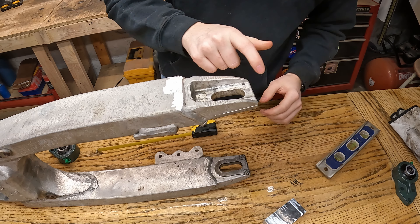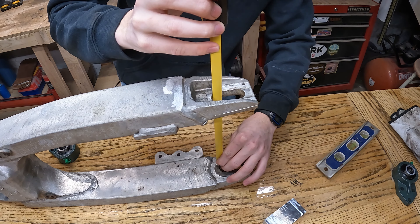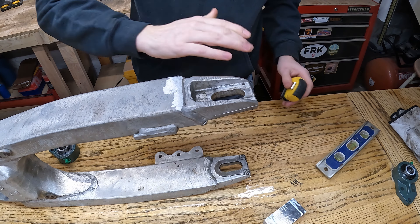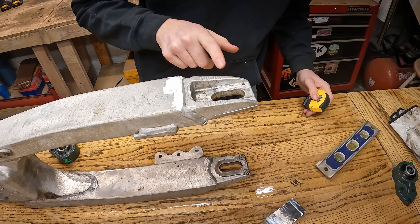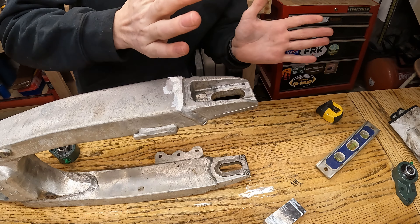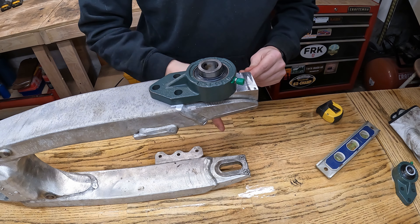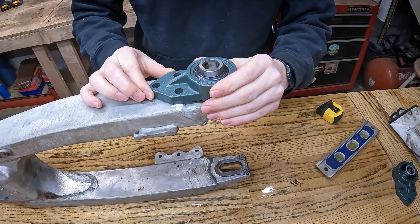I can see that they kick up a little bit, which indicates to me that this swing arm goes like this. I would have thought that this flat surface and the flat surface on the other side would be parallel, but this side is about seven and fifteen-sixteenths and over here it's about eight — maybe even eight and a sixteenth. That tells me it's kicked this way, and there's not enough wear to make up almost an eighth of an inch. I think if I bolt this on here even though it's kicked a little bit, there's enough distance that it's not going to create an issue. If it does, I can just shim up the back a sixteenth or so.